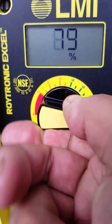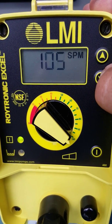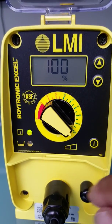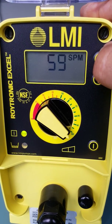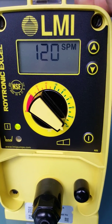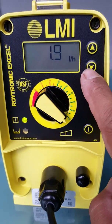So I'll ramp that right back up. There's another method of control — I can also reduce the speed of the pump. You can hear it slowing down. As a result of slowing it down it's now doing 0.9 litres per hour. If I speed it right back up to the top, the output will also change and it'll read 1.9 litres. So there are two methods of controlling the chemical dose: one by the speed of the pump, and one by the stroke knob.